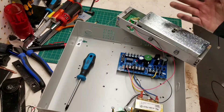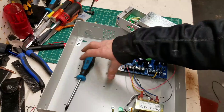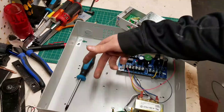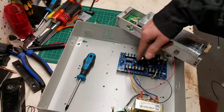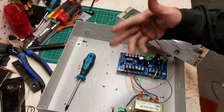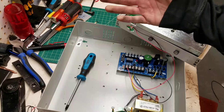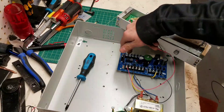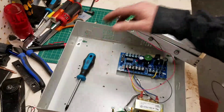I have no idea how this stuff works, but I do have it all wired up at the power supply. You can back this up with 12-volt batteries, and it will automatically switch to battery power, so even if the power goes out, these maglocks will still work. It has contacts on here for the fire alarm system, so when the fire alarm goes into alarm, it will drop all the maglocks so not everyone's trapped inside. It also has some other contacts for power to alert someone if the AC power goes out or the battery dies.